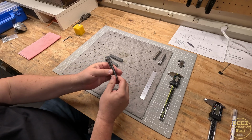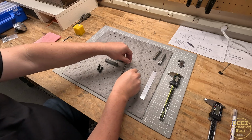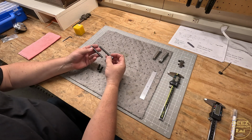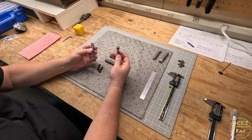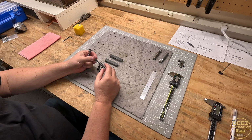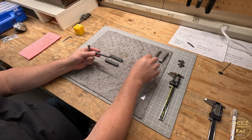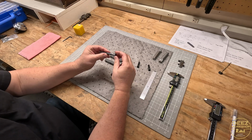Did make a change on the length of the threaded portion so that we had more travel for our clamps. But I abandoned this whole idea. I wasn't doing it right. And I think you'll see from that video that I really paid attention to order of operations, trying to move the workpiece as minimally as possible. And I finally decided to quit being so darn lazy, and I used my tailstock to support this thing so that we could actually come up with a proper threaded thumb screw. So this one turned out a lot nicer with the knurling.